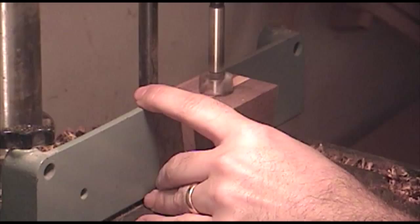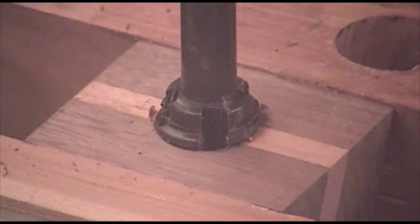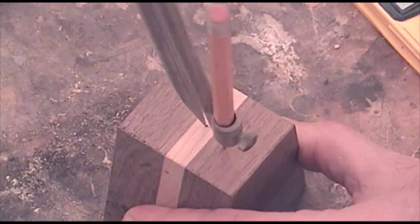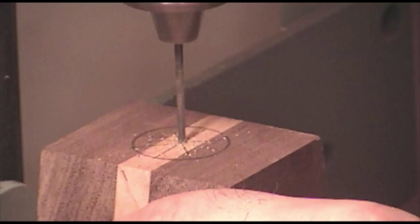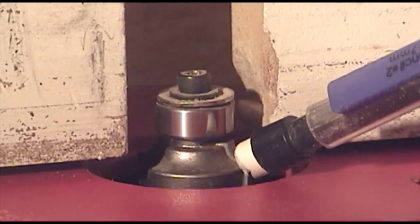In the bottom of each shaker, I need to drill a 7/8 inch hole almost all the way down to the very top of the shaker. Now I'm just tapping for a 1 inch dowel, which will be threaded in to plug the hole. To lay out the holes in the top of the shaker, I marked the center of the top and then with my compass made a 7/8 inch diameter circle. I checked salt shakers we have in the house, and the holes are around 5/64th inch in diameter, so that's what I'm going to go with.